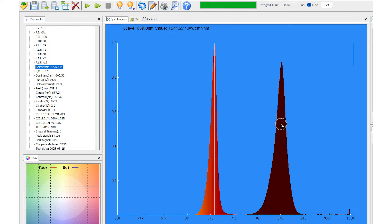As you can see on screen here there are two big peaks of light. We have the red light peak coming in pretty much bang on 660 — 659 nanometers — which is really good. And then we have the near infrared peak coming in at around 853, so you've got your traditional 660 and 850 nanometer light. One thing I'll mention: it was actually quite hard to get a reading that showed two nice peaks like this. Most readings had a high peak of red and not much near infrared, or vice versa, and there was a lot of variance at that six-inch mark — so we're not getting the nice blend of light we see in some other panels, though that may improve further out.